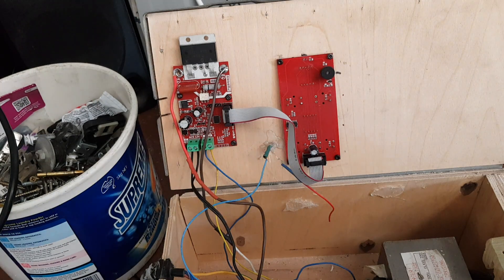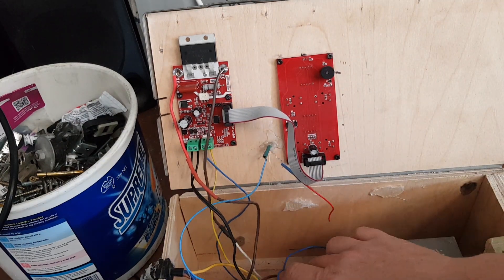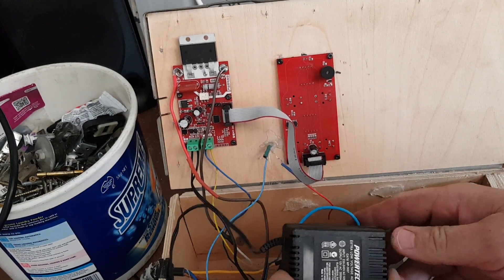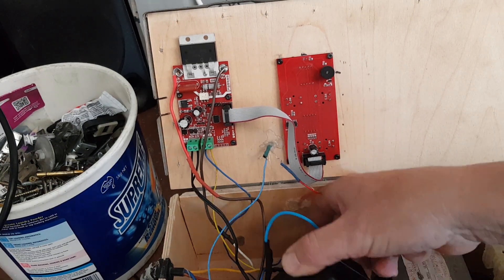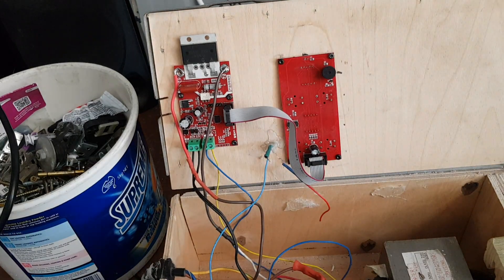Chuck here with my spot welder - I made it myself. I made a bit of a mistake when I originally did the setup: I used a DC power pack but it needed an AC power pack, so I've got a 20 volt 2 amp power pack now. If you have not played with electronics or electrical stuff, if you're a kid, don't build this yourself - get a parent or someone qualified to help you. Do not touch 2 amps; in fact, 10 milliamps across your heart will kill you.